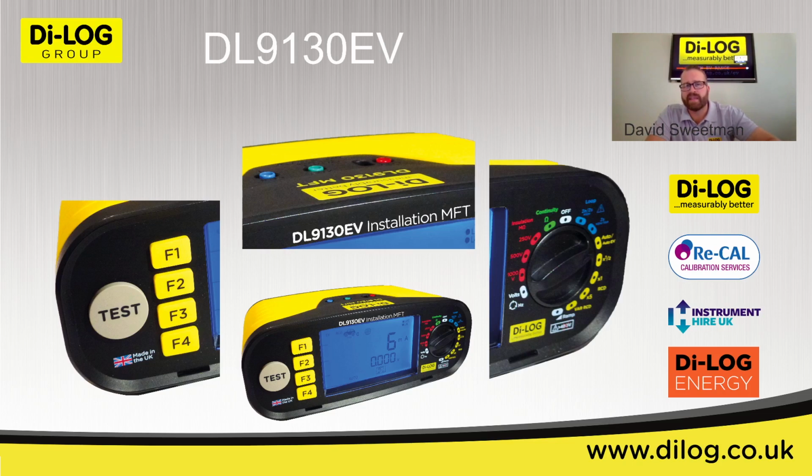And the concept behind this is it's all in a logical sequence, so from the off position rotated anti-clockwise to the left, continuity, insulation and voltage is the sequence that you would do a standard test sequence or EICR report from. So you start with continuity, then the insulation, look for voltage, and then you rotate it to the right where you've got your live tests, which includes your fault loop impedance at high current and non-trip.